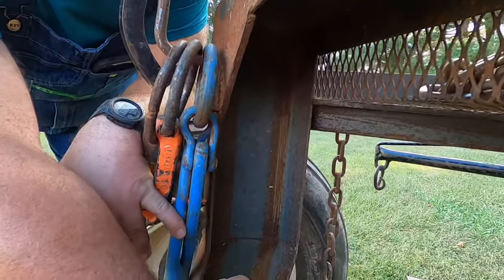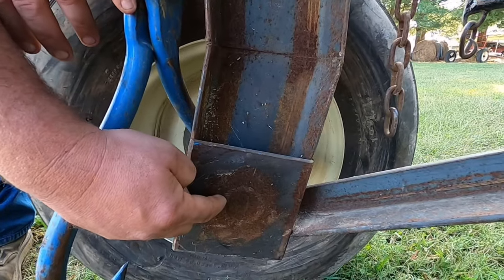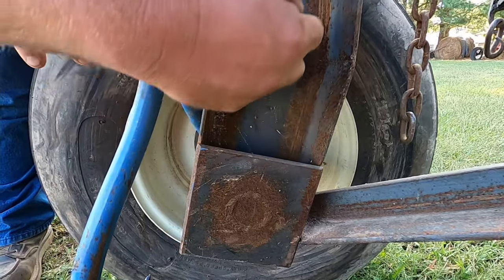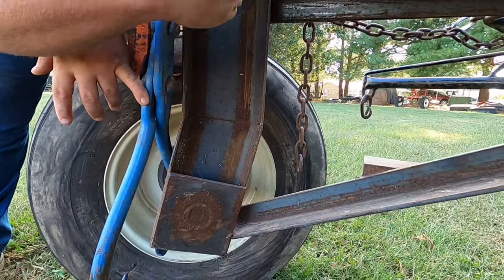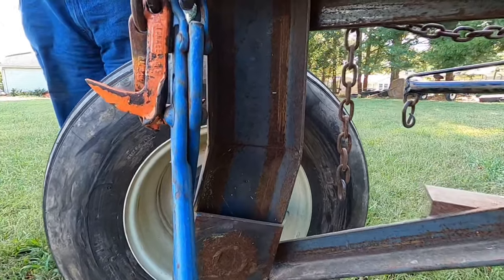It comes down, and if y'all look at the shaft where I've got the shaft welded in, look right down here where this shaft is. This shaft is approximately 3/4 of an inch to the back of the center of this upright up here. So in other words, it comes down and it makes a sweep back. Okay, now let me tell you what that does.